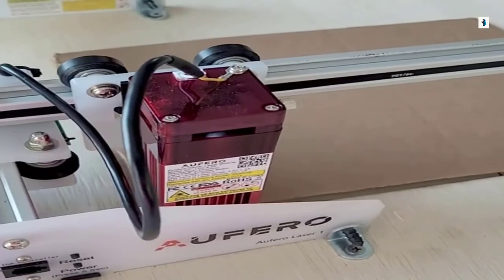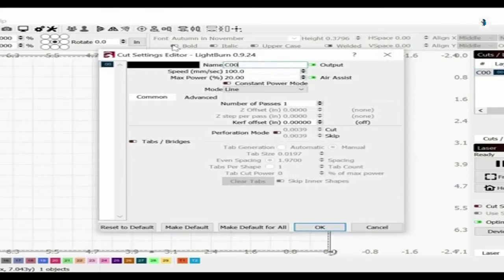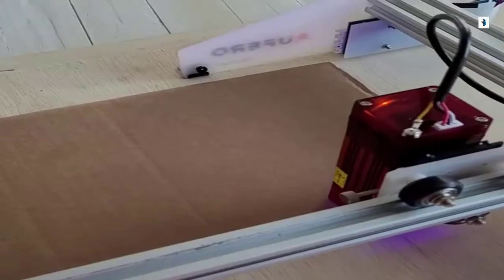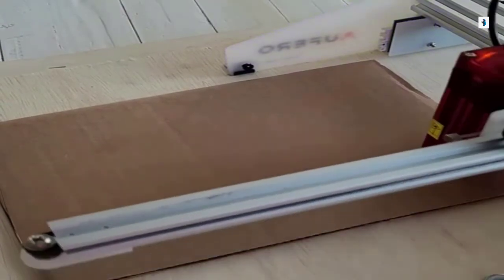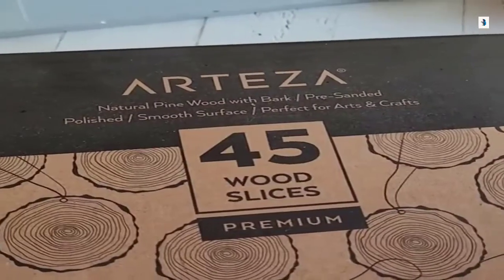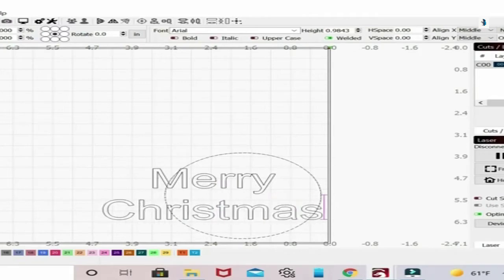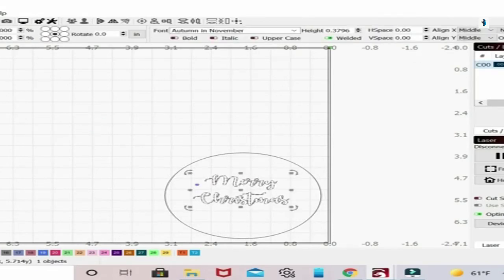The laser is compatible with Windows and Mac. You can either use the free GRBL software or you can use the Lightburn software to power the laser. I'm familiar with Lightburn, so that's what I'm going to be using today. I'm going to open up Lightburn and because we're working on a 7.71 by 7.71 engraving area, I'm going to draw a 7-inch square. I'm going to power up the laser to draw that square onto my cardboard so I know exactly where to put my materials. I'm going to jump right in with my Arteza wood slices — these are roughly 3 inches in diameter. I'm going to draw a 3-inch circle and pick a pretty font and just type Merry Christmas.